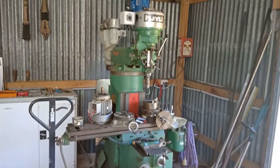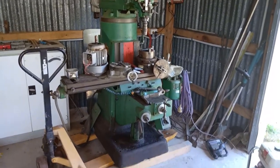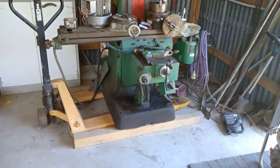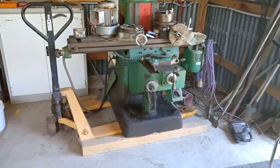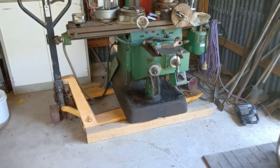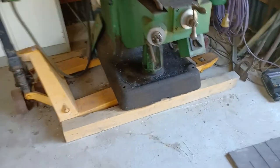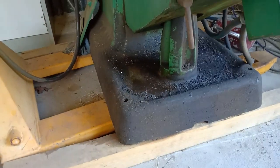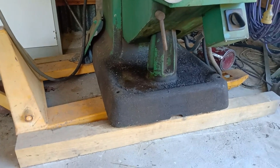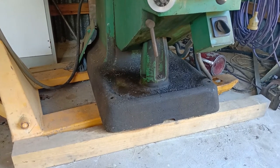This is the milling machine that the blocks are going under. I'm presently rebuilding it. Made in India, apparently. Weighs a ton, or thereabouts. Awfully heavy to move. Now, it's sitting on blocks of wood, but I need to lift it up a little bit further, hence these big noggins we're cutting today. So where these bolt holes are, there's one in here, another on the other side, and two at the back as well. I'll drill through the new noggins and put some threaded bar right through so I can bolt it to the actual timber itself.